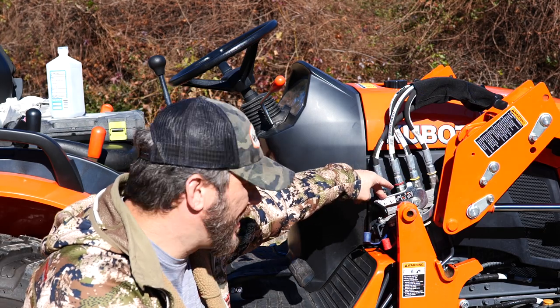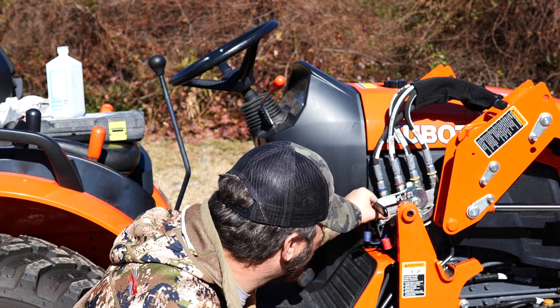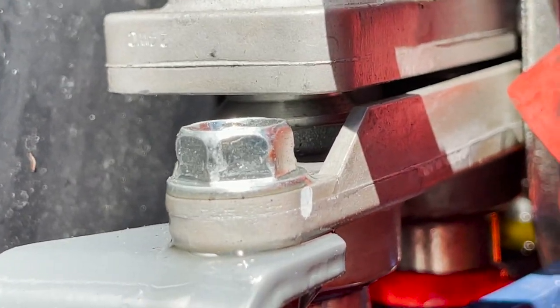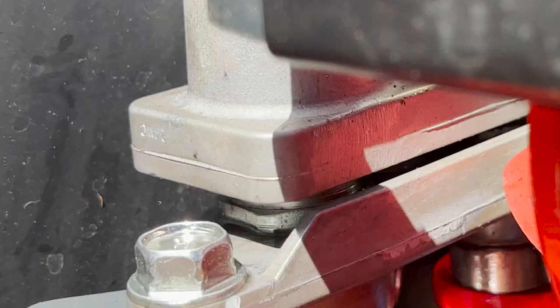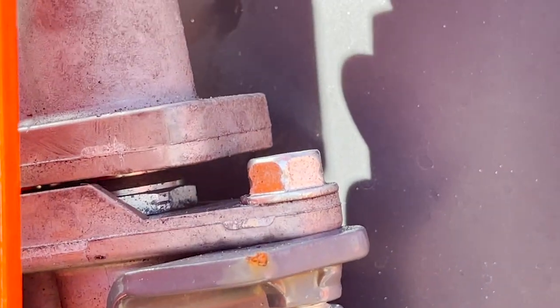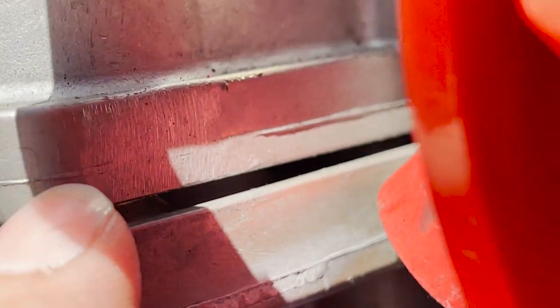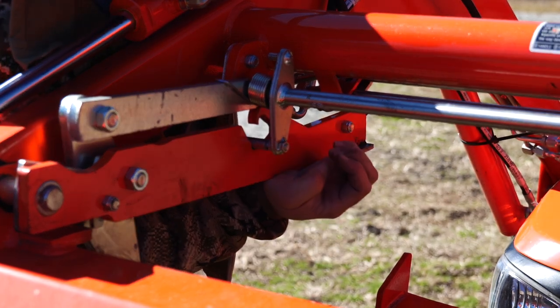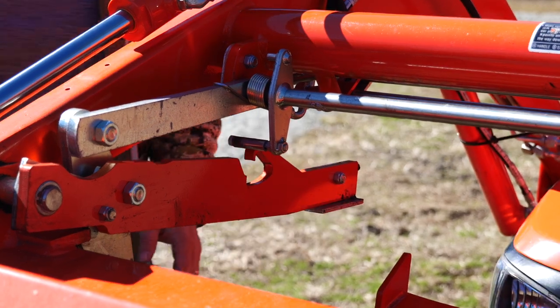I can see here that the front is nice and tight, but in the back I've got a good sixteenth of an inch of space. It definitely looks like it's not seating all the way there, and that would explain why it's leaking from these back three but not from the front one. I mean, if you look at how close the front is versus that gap in the back, that's a big difference. Whenever I reconnected it, I had to manually do it — there's something not right there. The connection for the hydraulic lines still looks wonky.